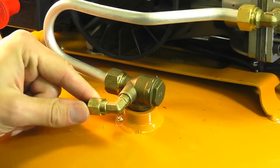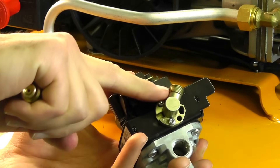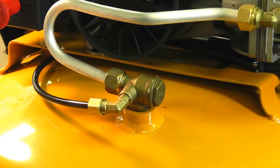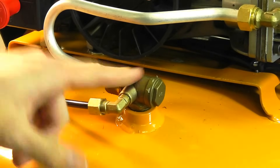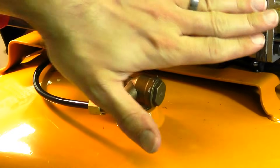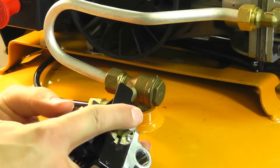The unloader valve routes from the unloader line all the way to the on/off switch. On a larger compressor the unloader valve looks like this — here's your pressure switch with the cover off, and the unloader valve is where the small nylon quarter-inch bleeder line attaches. After the unit shuts off, if air continuously bleeds out of the weep hole on the unloader valve, you have a defective check valve. It's not sealing — likely due to debris from the pump head or moisture causing rust. There's a diaphragm or ball-and-spring inside that isn't closing, so it back-feeds tank pressure through the main discharge line, putting back pressure on your head — which can blow a gasket — and leaks back through the unloader line.